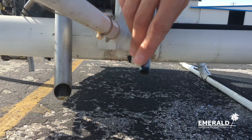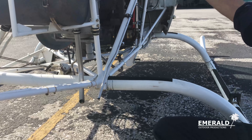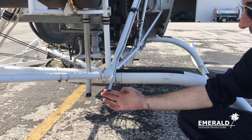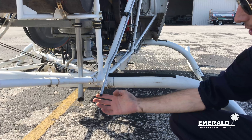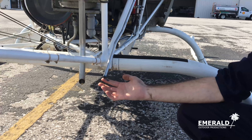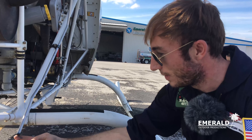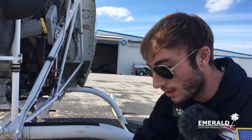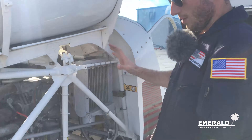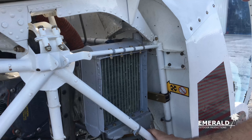Right door condition — we don't have doors, so we skip that. We check the static vent on this side, which is clear. We look at the right skid tube — we don't have to step back since we already checked the skid shoes from the other side. We want to make sure we don't have a 'smile' in the skid — it shouldn't be sinking or drooping down, which would indicate a hard landing. There'll always be a little sink but it should be hardly noticeable.